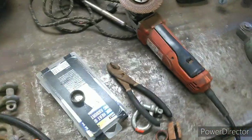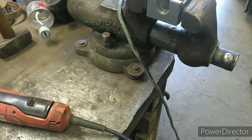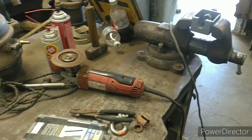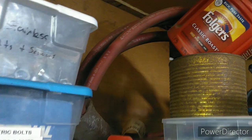The other thing we always use is a little bit of spray silicone — makes things go together much nicer. The reason that end I just showed you was buggered up is because we don't have any spray silicone. There's usually a couple cans in here but we're out. So I tried a little bit of Vaseline when I reset the one, and it worked for the barb but it did not work for the clamp. This stuff is one of those things that all stays together — stays in one spot.